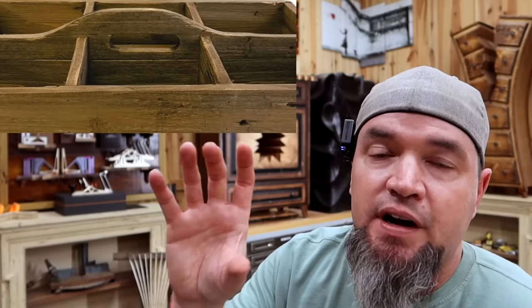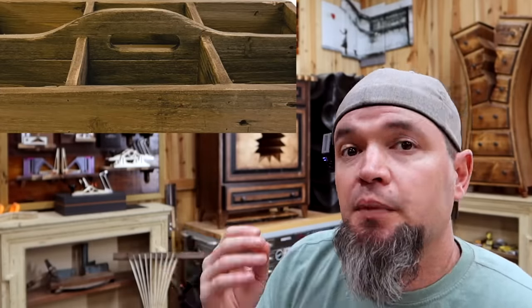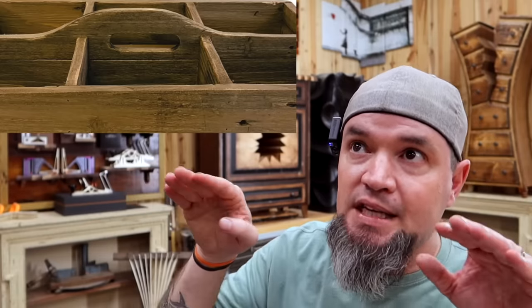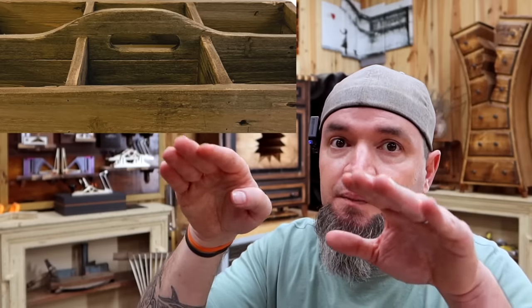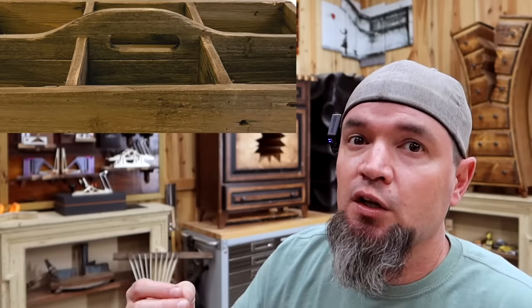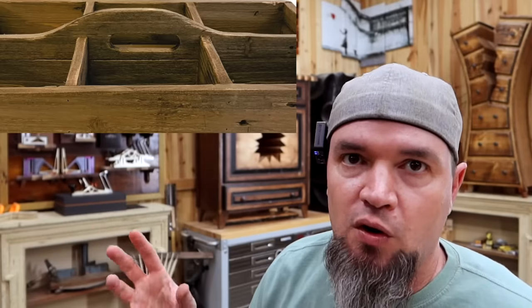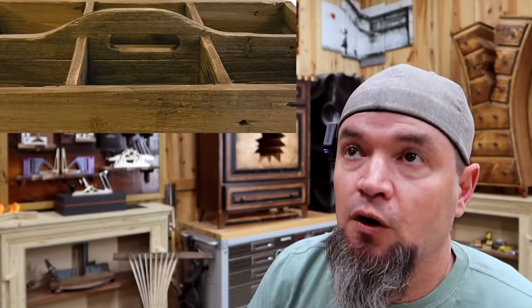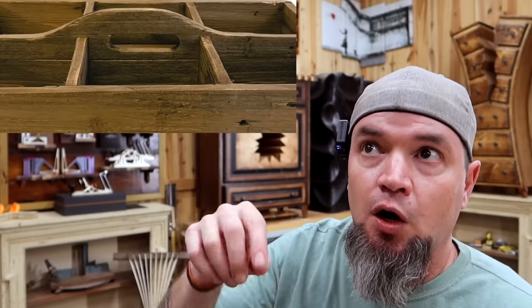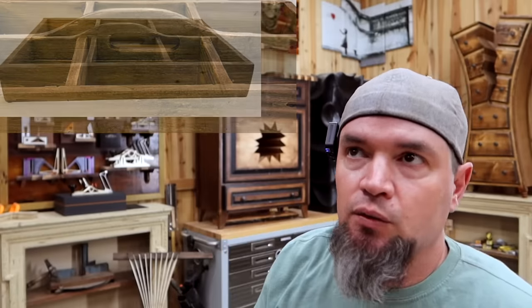I've used four-inch material for all around the sides and inside dividers. The very center where the handle is — that's actually a couple of boards glued together, but a five-inch board would be perfect. The handle is jigsawed out: from the sides go in four inches, then up for that extra inch where the handle meets. Very crudely, because you want it to look rustic — like it's been laying around some old farmhouse. Mark out your long oval, drill a hole wider than your jigsaw blade, then cut out that handle from the inside.